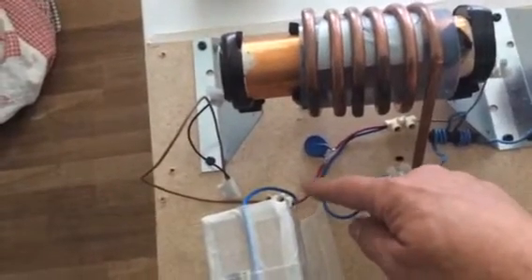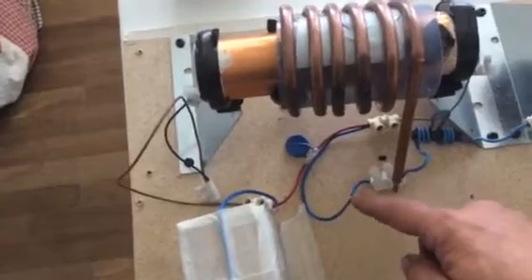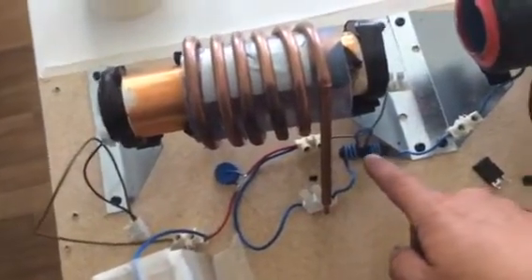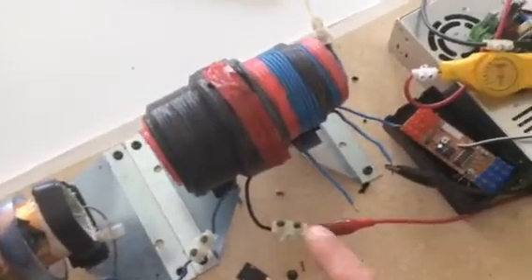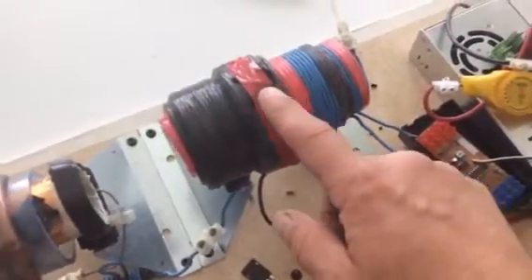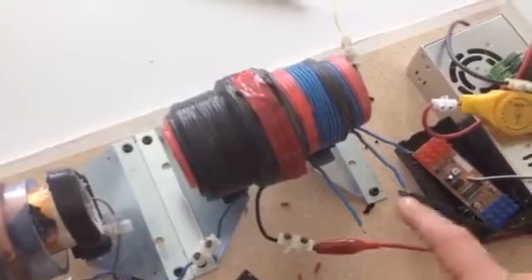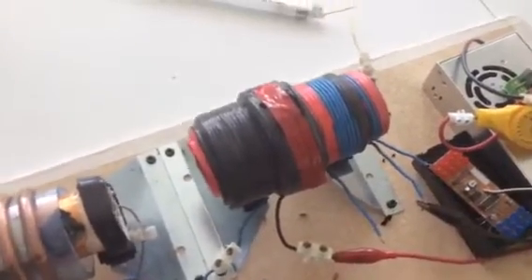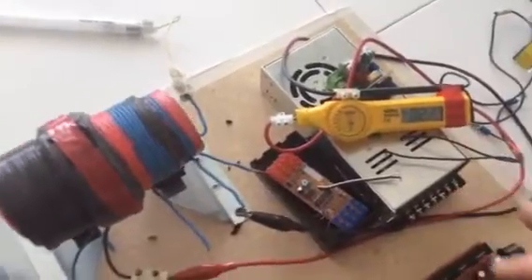One side of it is actually through to this capacitor, and then we come through this ferrite, in through to the ground, and then out through into an earth cable. These are extra bifilar windings on top — that's why there are four legs — and this is the AC output.